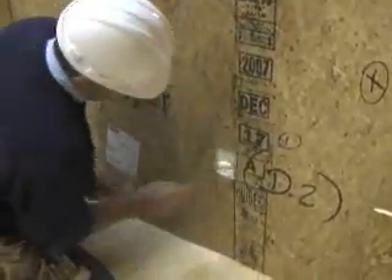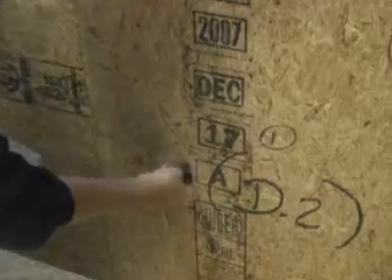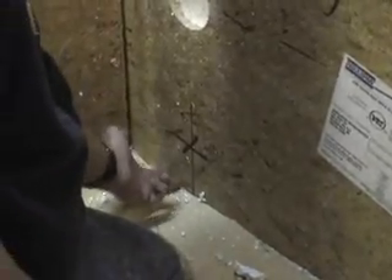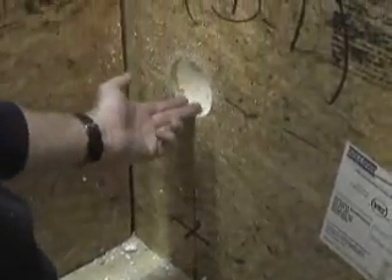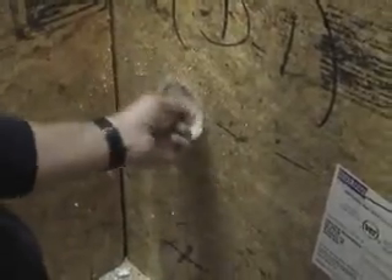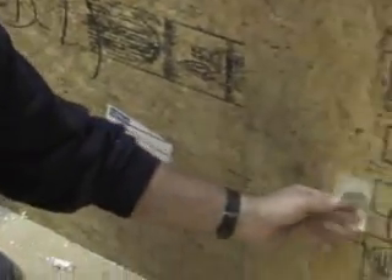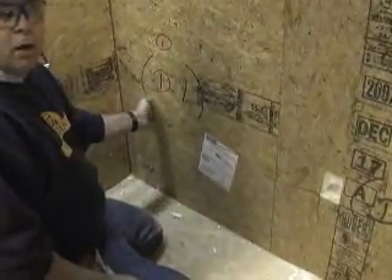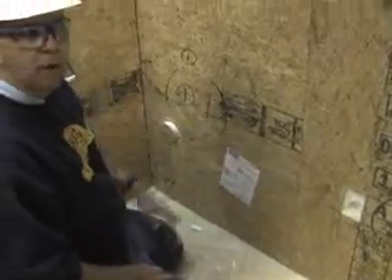You'll notice what's right there is that horizontal chase. This horizontal chase runs all the way along this wall and comes over here to where I've created this access hole, where the installer has labeled and marked the deck and the wall. So the electrician can now bring his wire up this vertical chase to this height, where I can then pull the wall wire over to where the box is going to go. Then I simply take the plug, put it back in the hole, foam it up, cover it up, and once we're done, you'll never know that the electrician came this way.